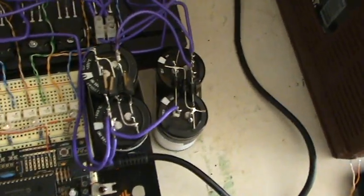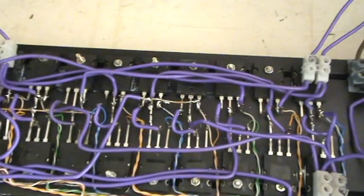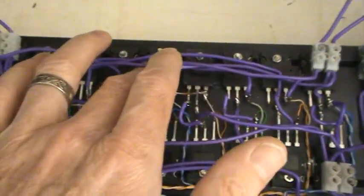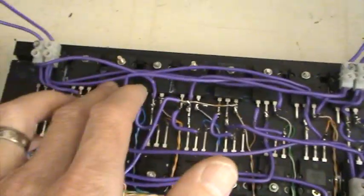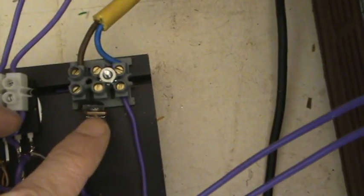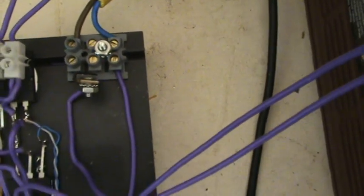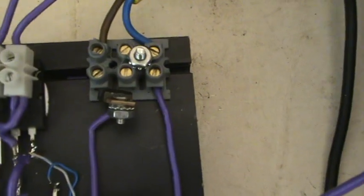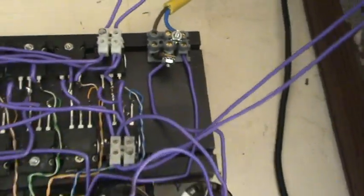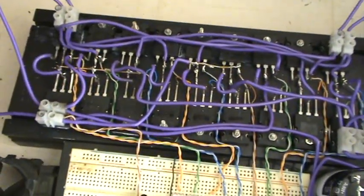I found that doubling up those caps does help even with solar and I haven't blown any transistors yet. The only thing that's warm — all these transistors are a little bit above ambient temperature. The only thing that's warm is the diode I've got coming off the solar, which I think is D8. It gets quite hot, probably about 50 degrees or something like that, which might be okay but something just to keep an eye on. But everything else is staying cold, which is nice.